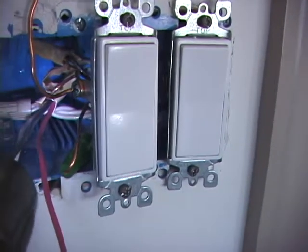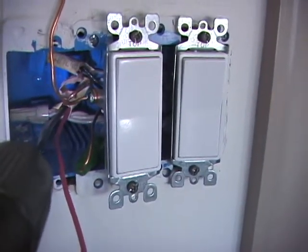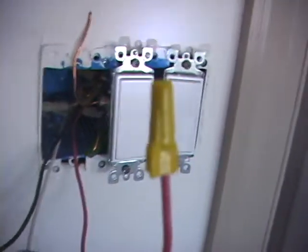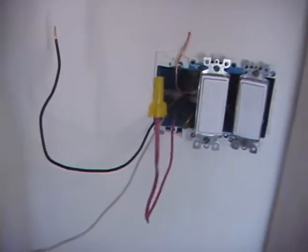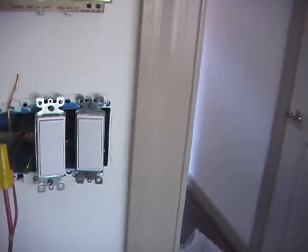well, but it's basically a yellow wire. And that's the new color marking for number 12 wire. So we have 3-conductor number 12 wire. Now the problem here is this is hot.